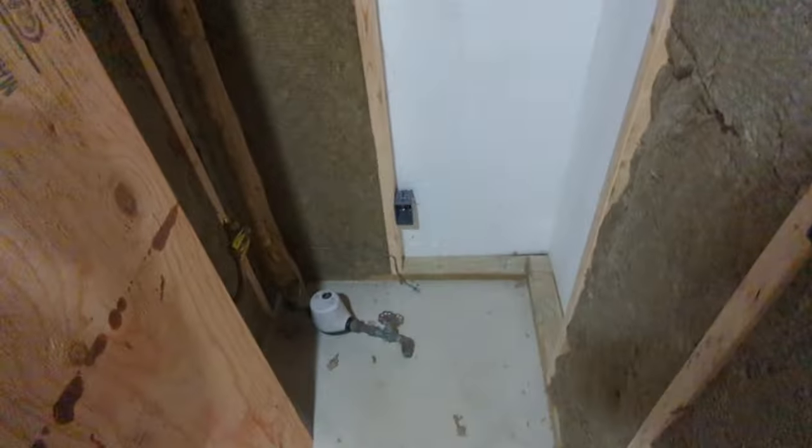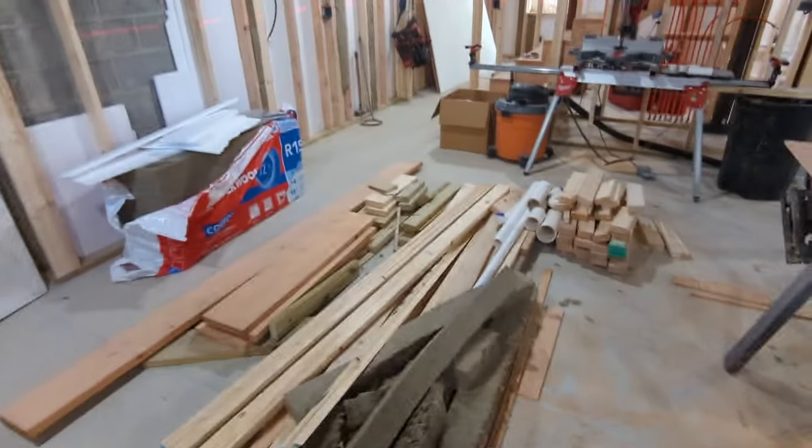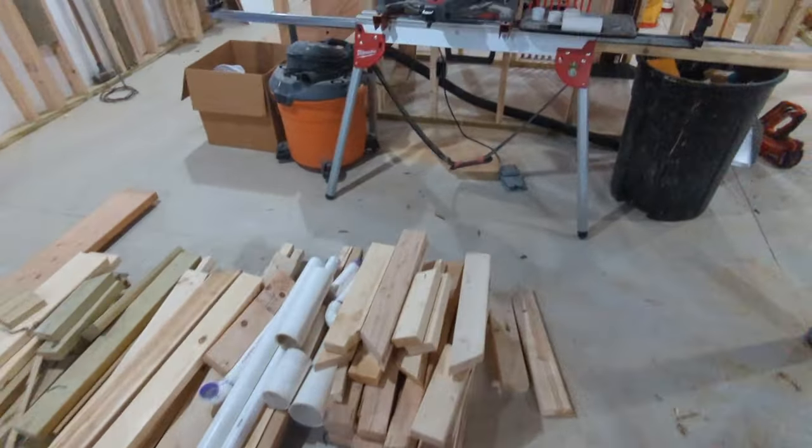And, you know, if the door opens like that, well, then it's unhandy to go out and around and plug in here. So then you're plugged in over there and you're kicking through. Anyway, you want a couple things in a utility space. So again, I'd probably go to dual gang there. Light switch here. All the rest of these down low. It's one on the chimney over there to one side of the clean out. And this is, you know, my thinking, kind of these areas.